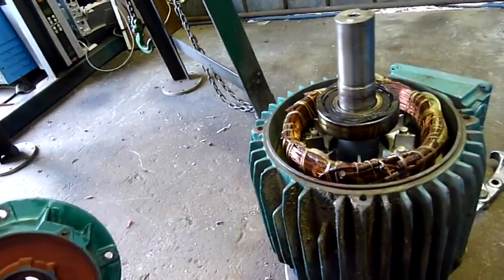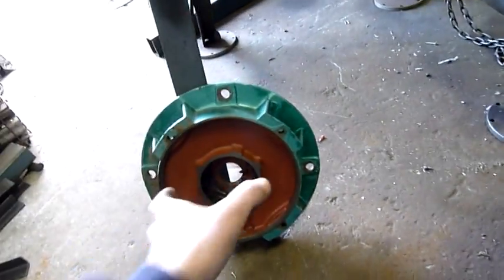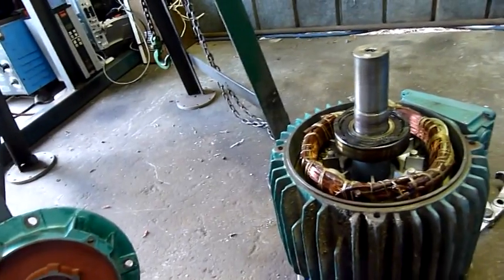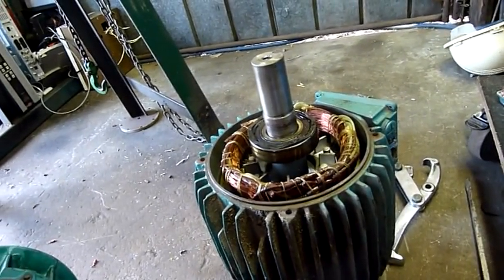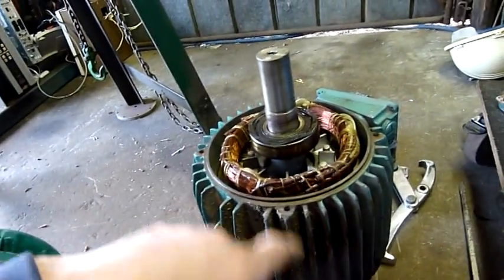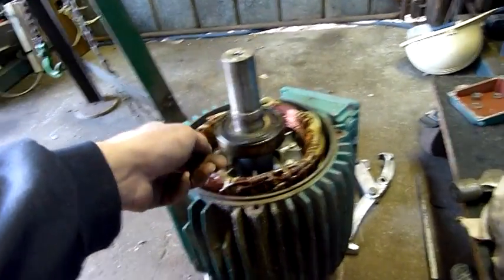If I make it out of half-inch thick aluminum plate, I could even fit another self-aligning bearing to give it a bit of extra support — double bearing it. That way I can drive it straight off with the Yanmar diesel and it'll go pretty well. Alternatively, I could use a self-aligning bearing to take up any misalignment between the engine and the power unit, because that's going to be a big issue. Apart from that, it shouldn't be too bad.